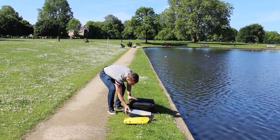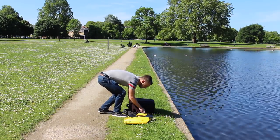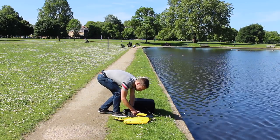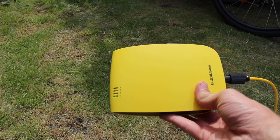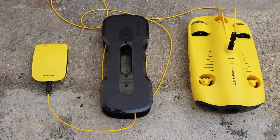So instead, you have to look to the base station. The base station does have four LED status lights. There's a green LED that indicates the base station's power is on, then there are two blue LEDs for the Wi-Fi network, and there is a final blue LED for connection to the drone. For correct operation, all four LEDs must be lit continuously and not flashing.